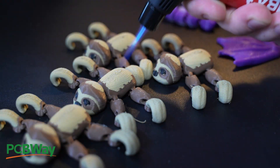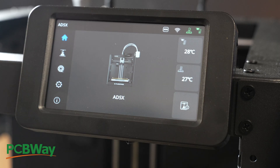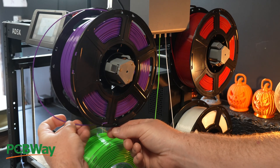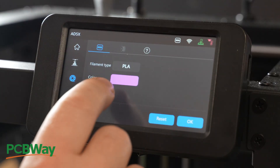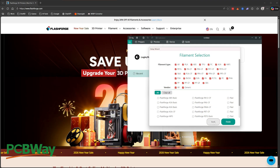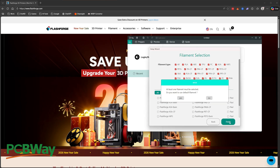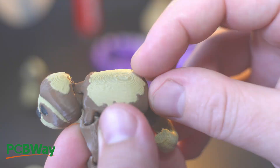I wanted to test consistency, so I swapped to some Bambu spools — which fit fine — and printed a plate of articulated sloths. Changing spools wasn't intuitive: there are two icons, neither labelled clearly. I had to guess which one retracts by the icon. It heated up, slowly unwound the filament almost to the drop point, and you have to be careful because if it falls off, your spool might unravel. So you load the new spool, wait for it to feed in very slowly, manually set the type and colour again, and repeat for every spool. And here's another kicker: I loaded Bambu filament, went to add it in the slicer, and the only options are Flashforge, Generic, or Custom. Where's Polymaker, Esun, or any of the major brands? I get not listing a direct competitor, but leaving out everyone else and making users do it manually is just annoying. The sloths printed fine — good detail, clean colours — but the experience could have been even better with variable layer height.